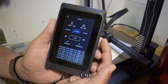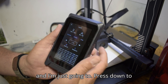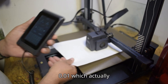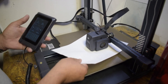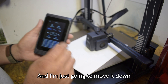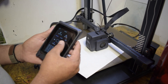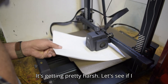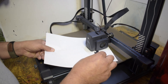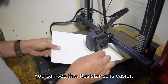We already did all the manual leveling with the wheels; now we're going to do the leveling digitally. Right now it's at negative 1.91 millimeters. I'm in the 0.1mm range and I'm going to press down to negative 2.01, which has some good resistance. Then I'll move to the 0.01mm range and move it down once. It's getting pretty harsh — let me listen to that.